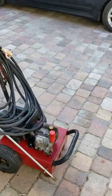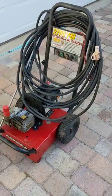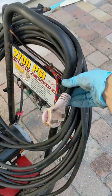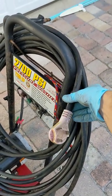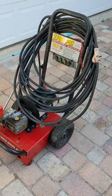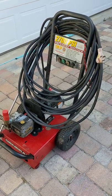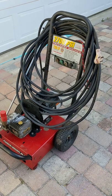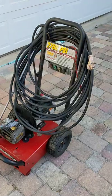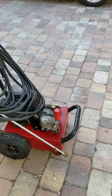So now I have a five horsepower electric pump. It does run on 220 volts. I wired up this RV-style plug — 30 amp rated plug and cord — and I just plug it into 220. If you want a smaller pressure washer, if you get a smaller pump, you can probably use a two or three horsepower electric motor and run that on 110. But for five horsepower, it's going to be 220. If you have any questions, please post them in the comments below.